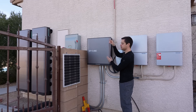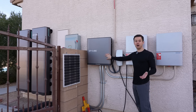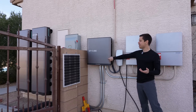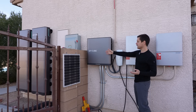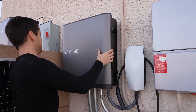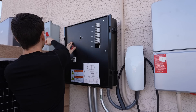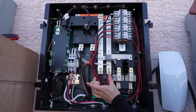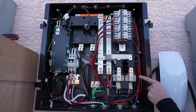The batteries connect to the gateway, which is the most important part of the system — the brain. It sits between your meter and your panel, and also serves as a sub-panel where you can connect loads, grid-tie inverters, and monitor them. These Delta grid-tie inverters connect to it and I monitor them on the EP Cube app. We also have an EV charger connected and monitored by the EP Cube system. Whether you have one battery or six, they all connect here. Be very careful — there are massive bus bars inside that could cause serious short circuits.